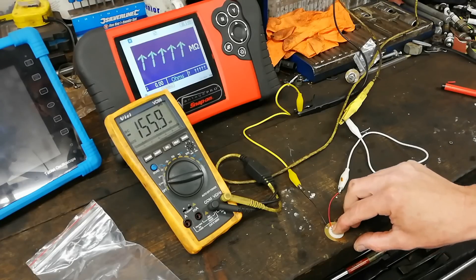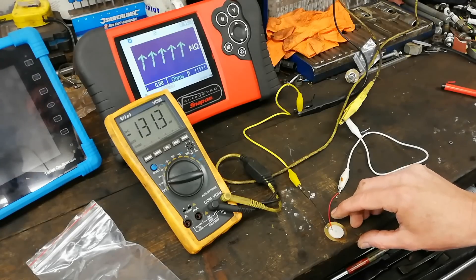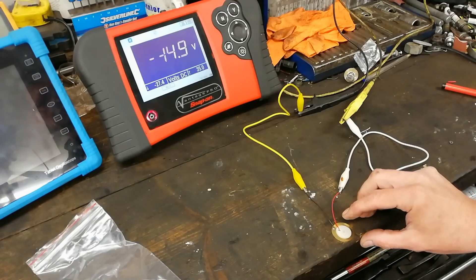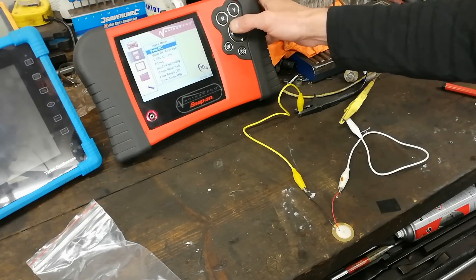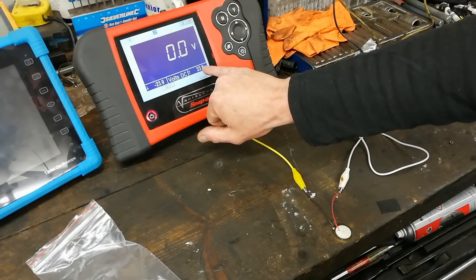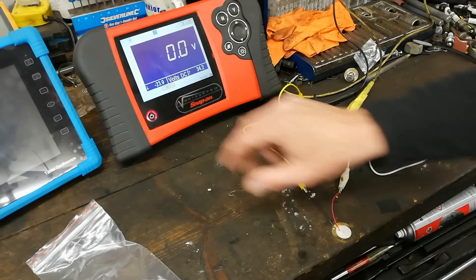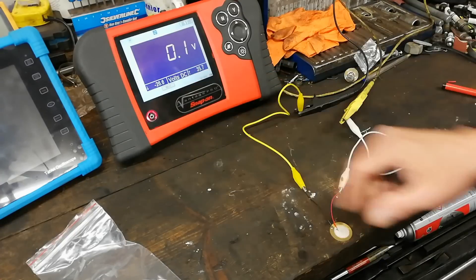We can see a voltage there. It's a bit clearer in the voltage - if I press it, positive and then negative. Press it - 16.9 volts there, it'll show a maximum of 35. I just reset the min-max there, so we've got 33.8 and minus 23.9. That's a good voltage there - the meter holds the figures. That's why I have it on a 50 volt scale - so plus and minus 30 odds.